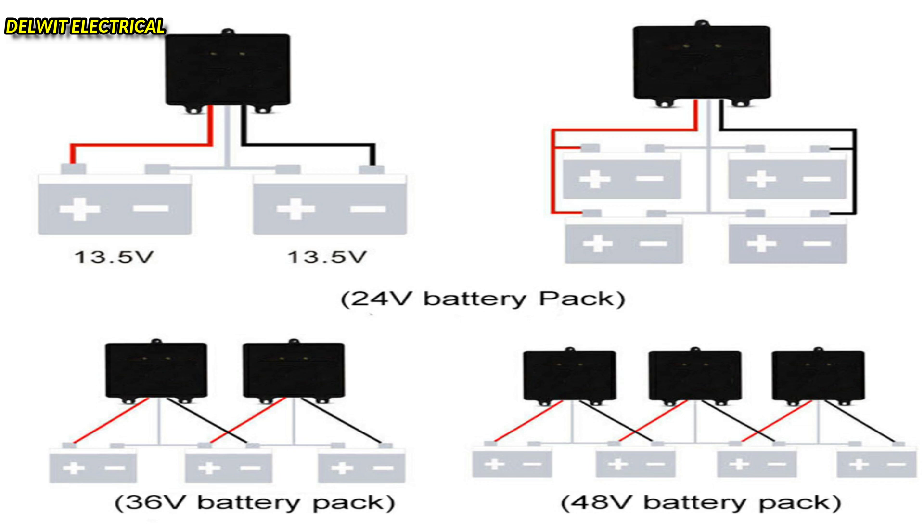There is also a battery management system that comes as a single unit with over eight terminals — red and black pairs repeated for each battery. That type is easier: the positive and negative connect to the first battery's terminals, the second pair to the second battery, the third to the third battery, and the fourth to the fourth battery. By the time you have connected this, you are monitoring the exact efficacy and well-being of each battery.